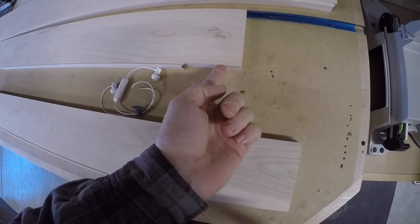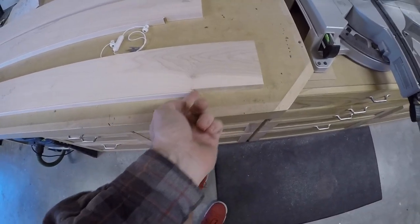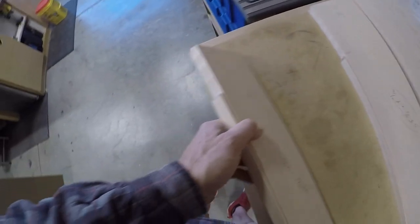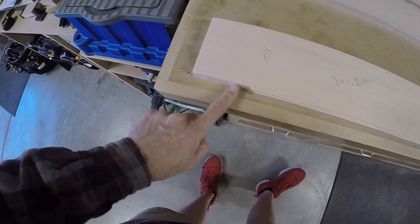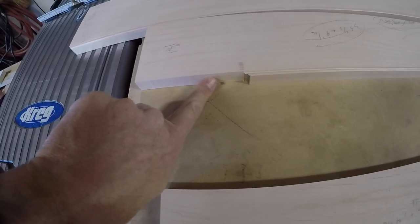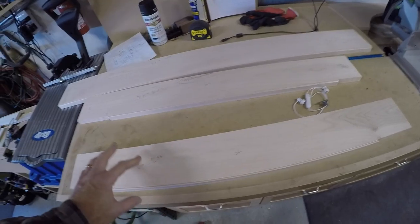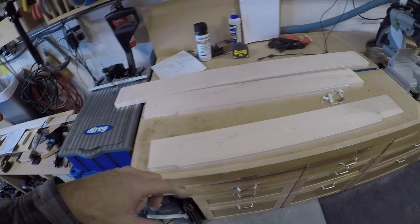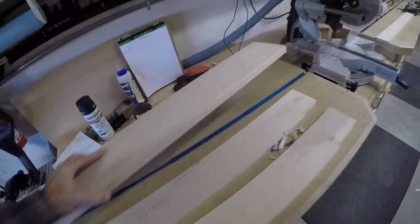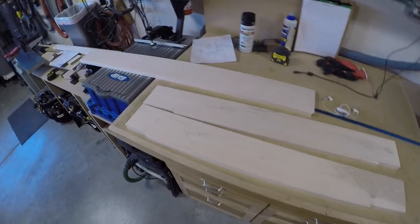Sometimes you'll get deviations in this part here, so your notches will be a little bit different as you do them. What I've found is that if you go through and just carefully do it again, you smooth it out — you may end up with little ridges, but they're just so microscopic. That's the bead right there that's kind of messed up from the burr. Now the top and bottom pieces — the rails — I'm going to put pockets in those. The ones with the miters are going to get pockets. I'll do three of them, and then put this together.